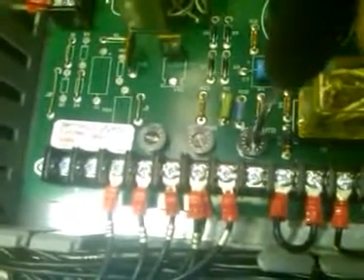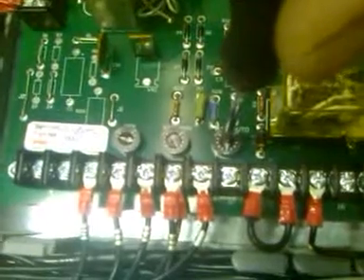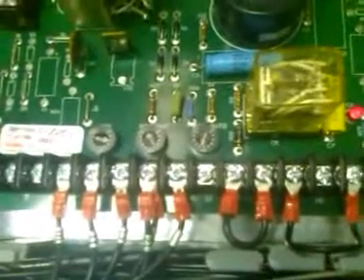This auto pot is for your DC signal — you only use this if you have a 4 to 20 milliamp DC signal. For the sake of argument, let's set it at 60 percent. This pot won't do anything unless you have a DC signal, but if you ever decide to add one in the future, 60 percent is a good setting.